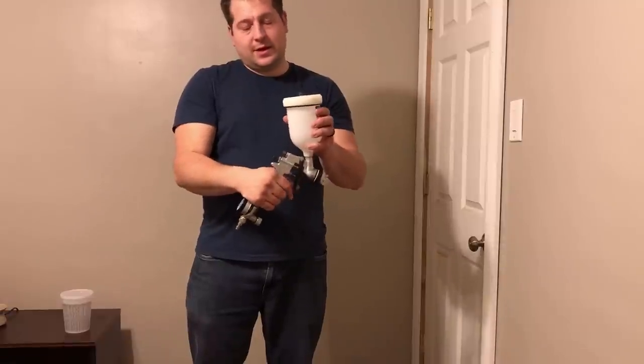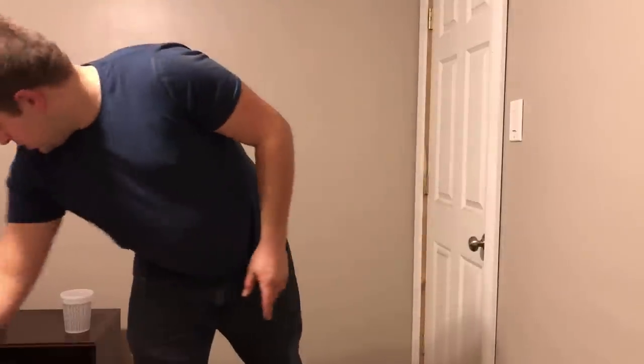Always make sure the cap is on because when you're spraying, air pressure is going in here — if the cap's off, you're going to have paint squirt out and that's not a good time. Another thing I picked up from Home Depot for about two dollars is this small container. It's great to keep extra paint in and do your measurements so you can be really precise about how much water you use to thin your paint.